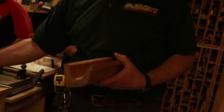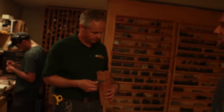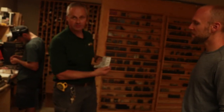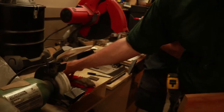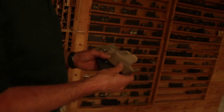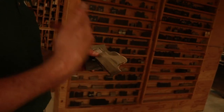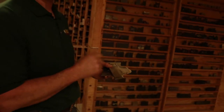That is cut with hacksaws and files. We now make all our templates out of plexiglass — these are some of the older ones. So we made another template for the side, and with the templates we grind two knives. These are ribbed knives that fit inside a head, and these spin in the machine at 8,000 RPMs and clean out the material and give us a nice finished product.